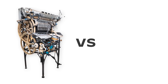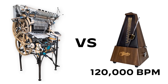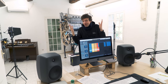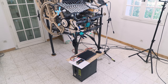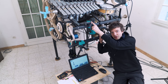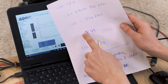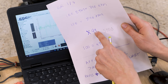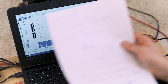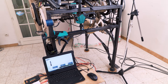For all the tests so far I had to manually set the tempo of the motor with the crank, but I got curious to see if we could actually program a defined BPM - for example 120 BPM. I called Alex and we can - he taught me how. We can now control the motor with the computer via a USB cable going into this controller. The motor is built in seven steps and the gear ratio from the motor to the pulley is seven. So we take 120 BPM times 49 - seven times seven - equals 5880. Enter 5880 and hit play and off it goes.